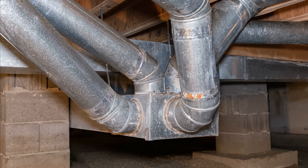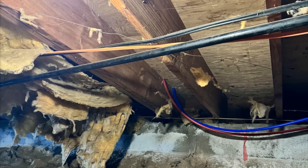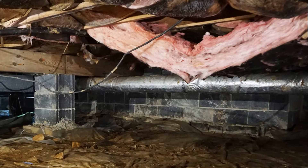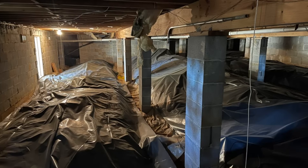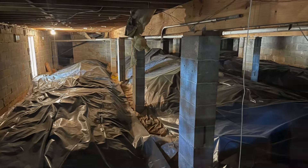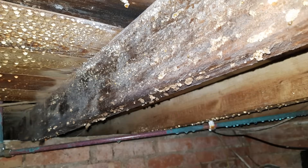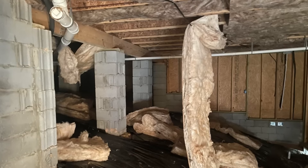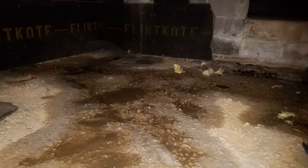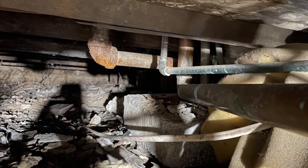The biggest problem when it comes to crawl spaces is that we rarely delineate between the indoor and outdoor environment, and it's very much treated like this odd hybrid space where anything sort of goes. Oftentimes, builders will just put a loose sheet of polyethylene down, insulate the floor joists, and call it good, whether the crawlspace was intended to be vented or conditioned, and we can end up with condensation issues. You'll often see batt insulation falling down in the crawlspace because of this, you'll see puddles of water on the vapor barrier, and overall it's an interstitial space that lacks any kind of control.